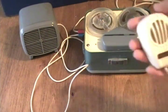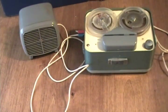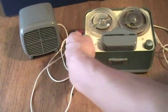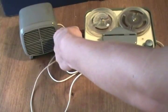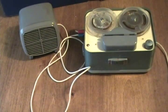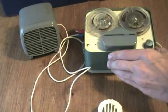So it can get very, very slow. Here's the original mic. You can hear distortion as it tries to put the very low frequencies through, which it does not do a good job at. I'm now recording at the very slow speed on the Phonotrix reel-to-reel tape recorder. Let's turn the volume up higher — it's up all the way. Let's see how it records at this very slow speed. I believe this is a dynamic mic because it has some weight to it — I think a crystal mic would sound way too tinny on this thing.